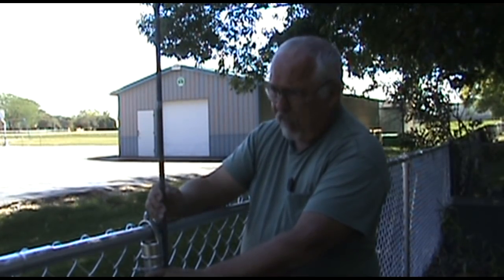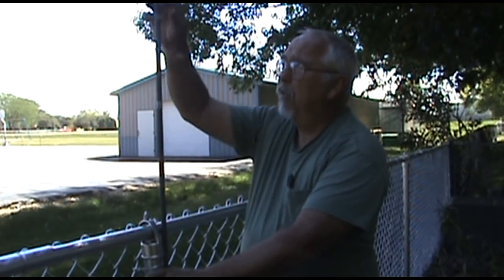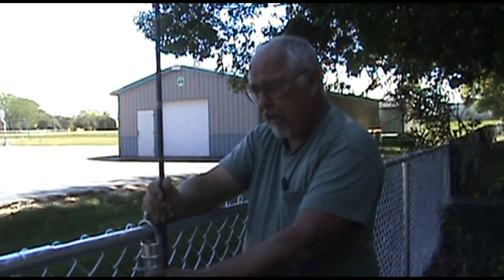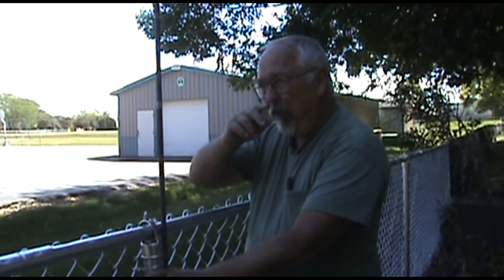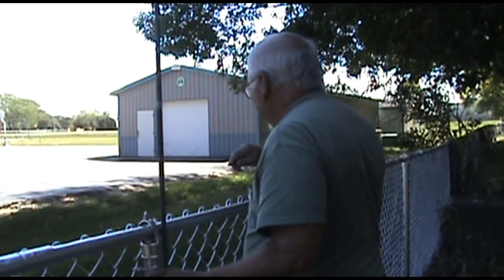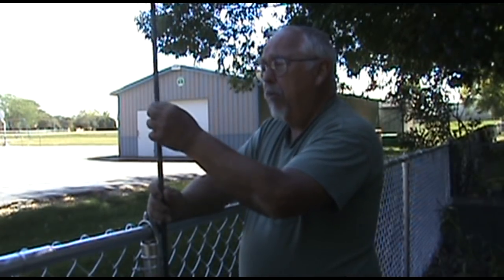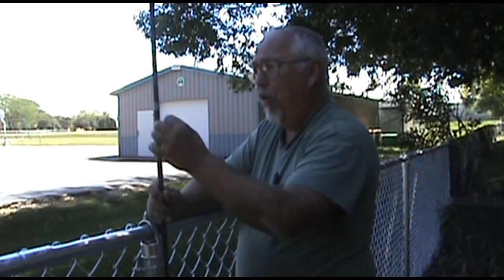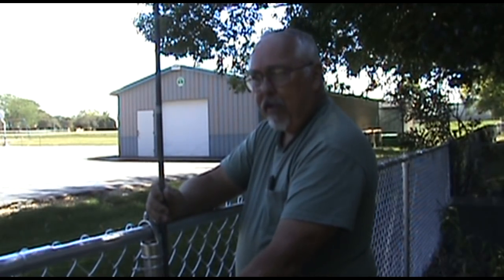another 24 inches. I'm actually going to extend it with 22 inches of rebar, figuring about a 2-inch cap to put on top. And I want to extend this so it's nice and level. I've already got rebar attached to a post down there, another down at the end here, and I'm going to string a line along here. I've marked these rebar with some tape 10 inches down from the top, so I can run a string along here, line these up to the proper height, and then wire these tightly.